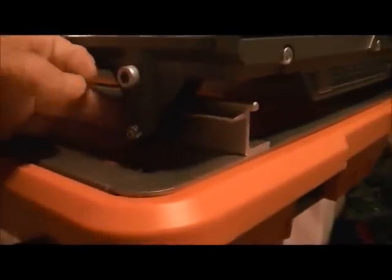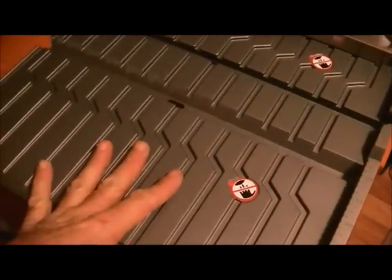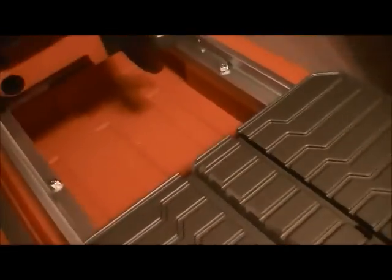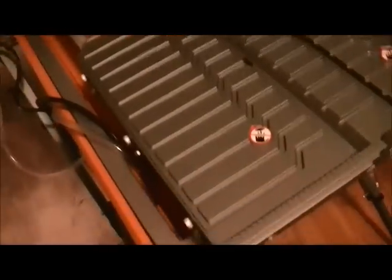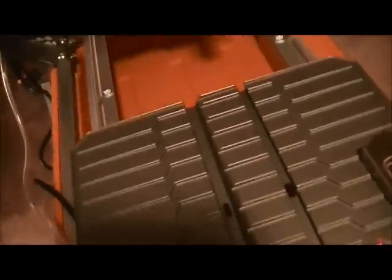If you can imagine these rollers that are locking into the bottom rail not being there, and just having your rollers sitting on that blade right there, same as over there, so you can move this table off the pan anytime you want to. That helps, that I can move that table off and I can do my back cuts without the impedance of the table there, is a big deal to me. Plus, this construction method that they use is much better on those saws than this one. Again, plastic tub. I'm used to a metal tub, or aluminum tub rather. There's just some nuances about this that I don't like particularly.